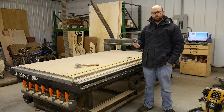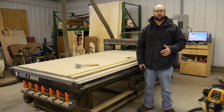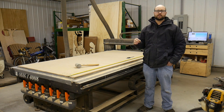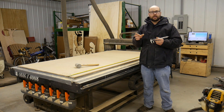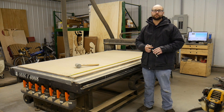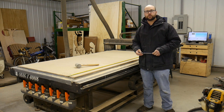It was a short little tip, but it's something I use. I've set up a few CNC machines — a plasma table, a router table, a 3D printer. I built a mostly-printed CNC router as my first CNC — 24 by 24 inch — then graduated all the way up to the big one here. Every time I've set up a machine, that's the method I've used, and I've always had excellent results. It's far more accurate than trying to hold calipers or get a cheap dial caliper to work. You don't need any special tools — just a tape measure. Lay it down, use the full width, and you're going to wind up with a much more accurate CNC machine. I hope this helps. Thanks for watching — if you haven't subscribed, please do so. If you think this tip was worth a subscription I would really appreciate it. Thank you and stay well.